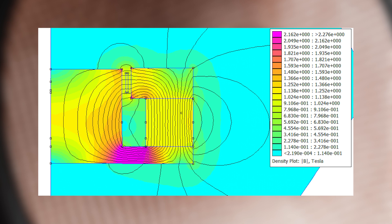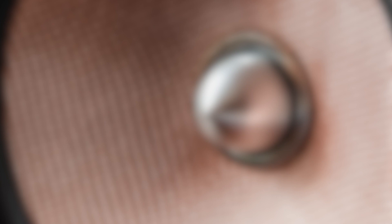While on the topic of motors, I wanted to touch on FEMM software — it's the first time I've used a simulation software to actually simulate the magnetic field throughout the motor. I just wanted to show the output of the motor used in this speaker. The simulation shows that the voice coil, which is a small rectangular element in the gap, is experiencing just about one Tesla of energy from the motor in magnetic force. Now we'll move on to REW and the DATS system to look at the graphs.